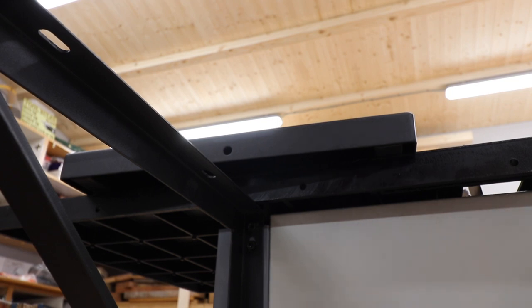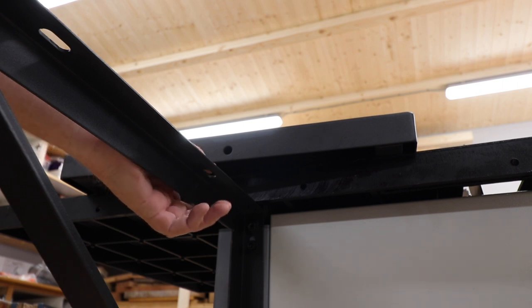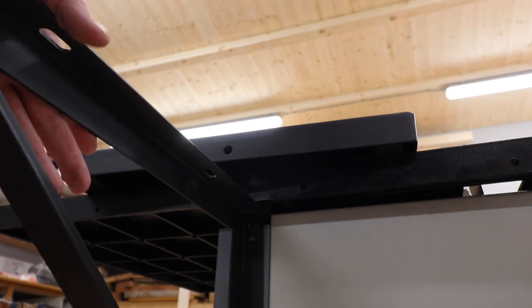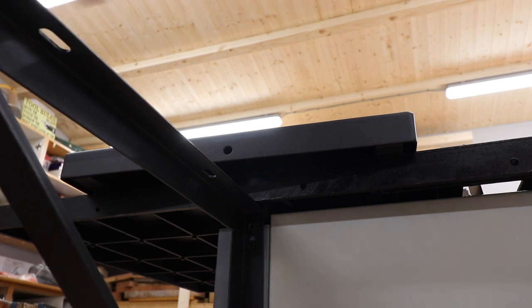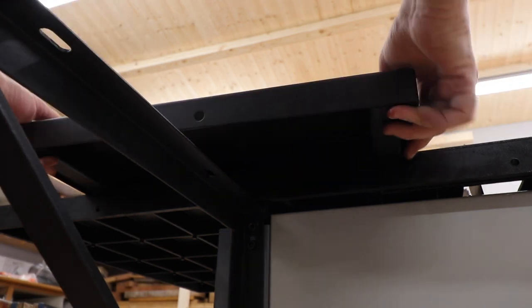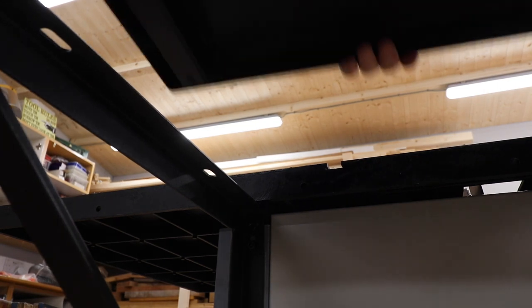Now we're putting the bracket extension table on. You've got the brackets, you put the brackets on earlier, and the bolts are going to be located through these elongated holes. There's two on either side. The screws or the bolts are only hand tight at this time, because we need to adjust it to the level of the main table. So I'll bring this on. That's the way around.